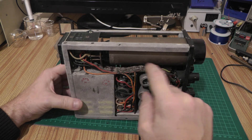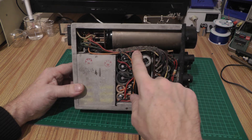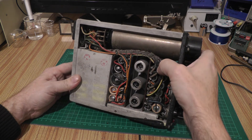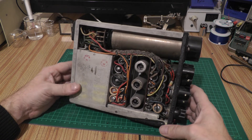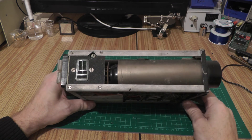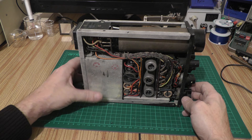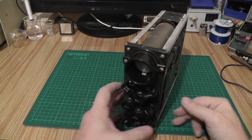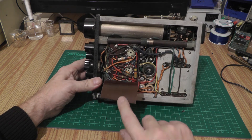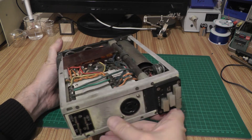Flipping it over, we can see our three cans which contain our valves. There are many wet capacitors with bulging rubber ends — every single one will probably need pulled out and replaced. I'll get the voltage ratings and values from the manual and start picking through and replacing every one. With modern replacements we'll probably end up with a hell of a lot more space in here. There are more capacitors at the front, probably mostly for time base, and others more likely for power. It's looking a bit foosty in there — full of mold — and all that will need cleaned off. The wiring is laced together in bundles, which was an art form in vintage equipment. There's also what could be pitch used for insulation.